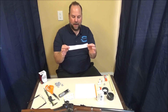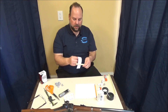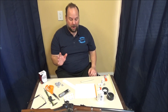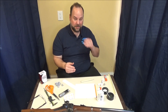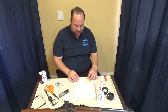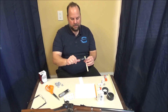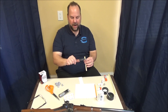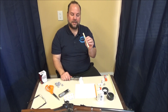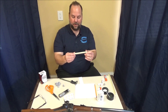Now we have a piece of paper that is the correct length for our cartridge. We also have to figure out how long it needs to be to wrap around the dowel. The answer is 1.89 inches, or just 1.9 inches. My dowel mandrel is about 0.52 inches in diameter — since you can't buy a 0.52-inch dowel, I took a half-inch dowel and wrapped masking tape around it until the diameter matched the heel of the bullet. That's how I made the mandrel.